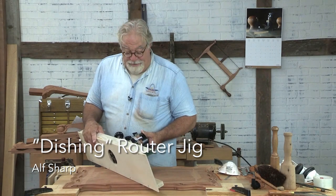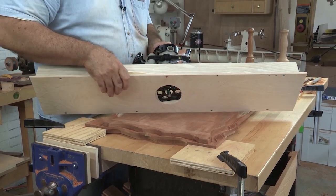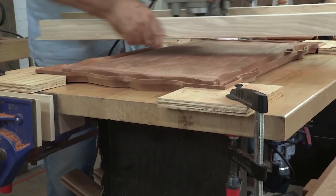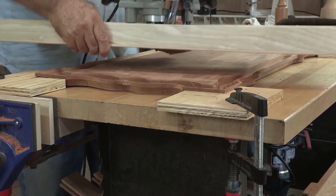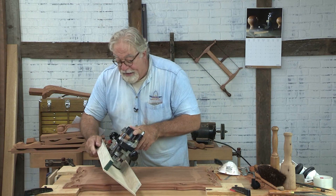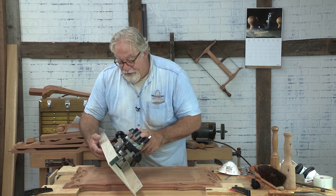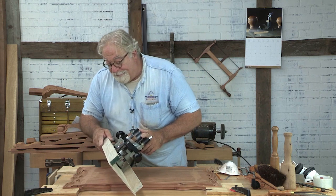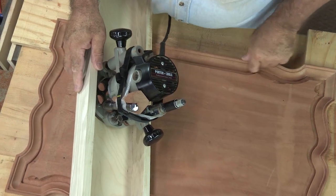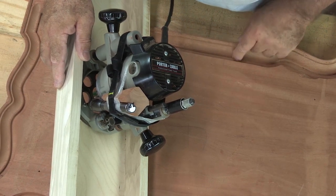So this looks like Yankee Ingenuity, doesn't it? This is my sled that I'm going to use to route out the middle of the table. It's built so that it can slide back and forth on the rim of the top, which stays at the full depth. The router is just held in there with double face tape, and these stiffeners here allow me to use a relatively thin piece of plywood so I don't use up a lot of the extension of the router. This makes sure that I can see when I'm getting close to my rim so that I don't run the router bit into the moldings that I've worked so hard to get.